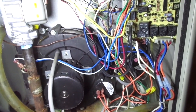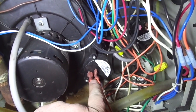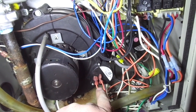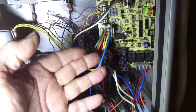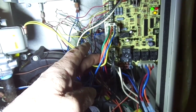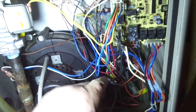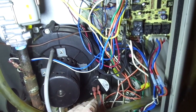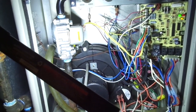I went through a portion of the sequence in the circuit board, but certainly not all of it. One thing I want to stress: you can see there's a pressure switch here and another one over there — they're not interchangeable; they both operate at different pressures. These particular ones operate on negative pressure, meaning there has to be enough suction established by the combustion air fan for those to close and send the signal through the circuit board so the algorithm will allow the heat process to initiate. There's also a sequence in the algorithm that prevents you from simply pulling the wires off and jump-wiring them. Because on a call for heat, it will recognize that those normally open switches are already closed, sending a signal to the board at the improper time, and it will still go out on pressure switch failure. So they try to make it as foolproof as possible so people cannot bypass and jury-rig these furnaces.